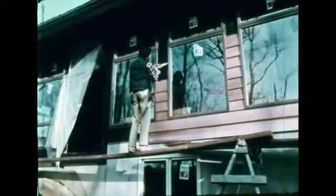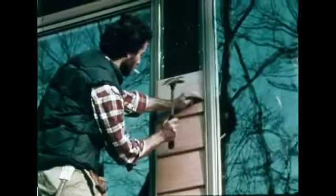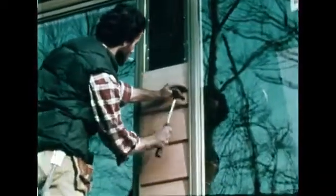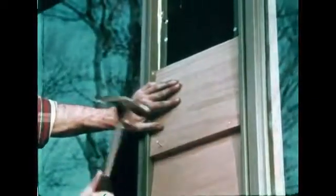Whatever type of siding is used, caulking behind it around windows and also doors and corners provides additional water protection. The siding used here is cedar clapboard, also called bevel siding. The wood is clear, free of knots or knot holes that might cause a leak. Eight-penny casing head nails, made of aluminum, are used to prevent rust stains from bleeding onto the siding.